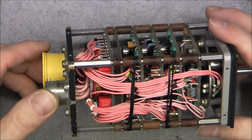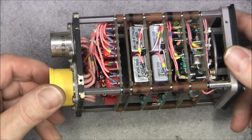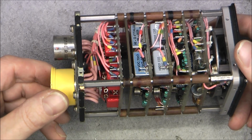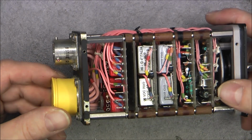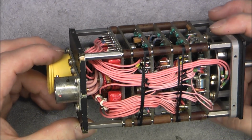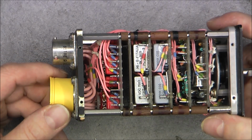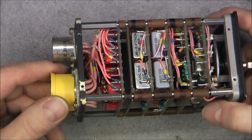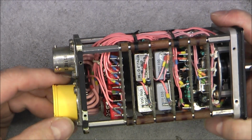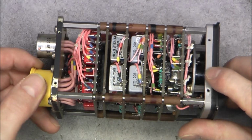Quite interesting. I have no clue of what this board here is doing, because it seems not to be power supply related. I have no bridge rectifiers, no smoothing electrolytic capacitors, just metallized capacitors and coils. Some kind of filters apparently for signals. Something like this. Quite weird. Okay. And a super nice setup here in the front.